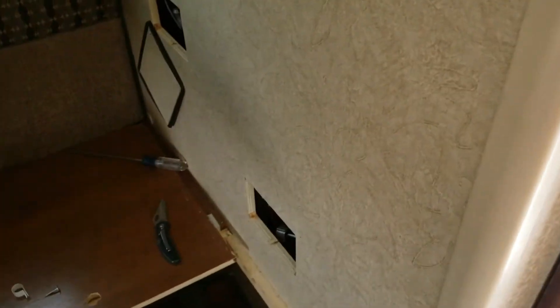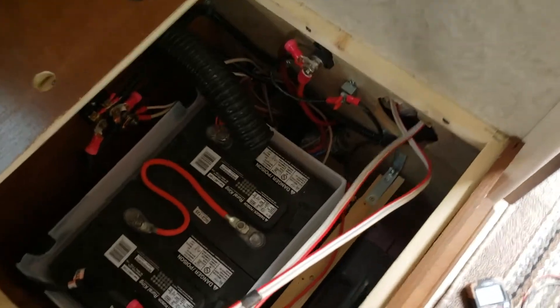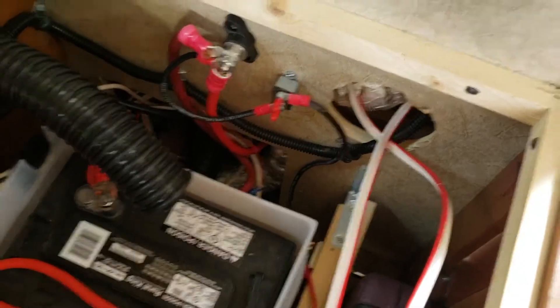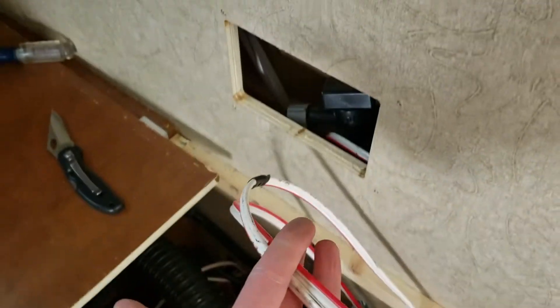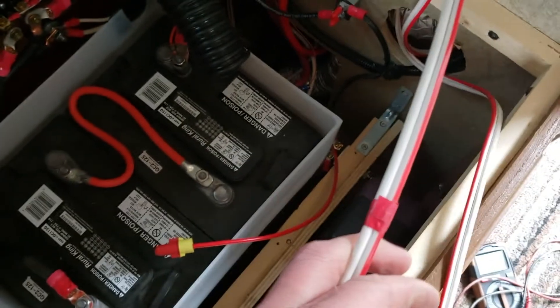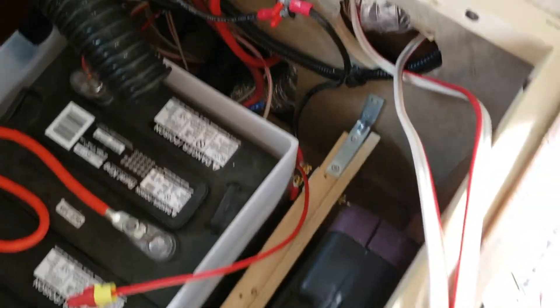In my Lance 825, where the solar wires come down inside is different in every camper — sometimes it's behind the sink, near the stereo, above the sink, whatever. In my case they were shoved up in the wall, which was confusing. There was a wire that came out at the battery box, but it wasn't actually from the solar panels. I found the two solar wires shoved in the wall after removing the access panels. The one with black tape is from the solar panel; the red one back-feeds over to the positive terminal block, and the ground is already grounded. This will connect to the positive terminal block after the charge controller is installed.